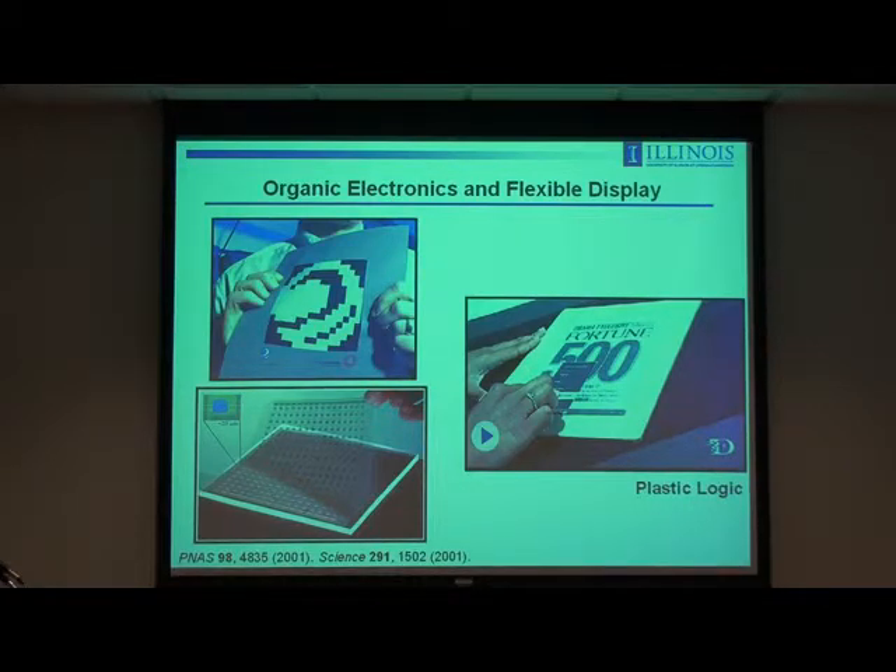But this technology is really miles away from what you need for the kind of systems I was describing, for two reasons. One is the organic semiconductor materials are pretty lousy — they're comparable to amorphous silicon at best, in many cases worse. For a non-emissive display that can't switch quickly anyway, it's a great match, but for anything more sophisticated, you're not going to get there with known organic semiconductors. The other problem is that although this represented a move from rigid glass to flexible plastic, a flexible sheet of plastic is not good enough for bio-integrated systems — you really need something modulus-matched to the tissue, elastic, and able to conform to complex curvilinear shapes, not just cylinders and cones.